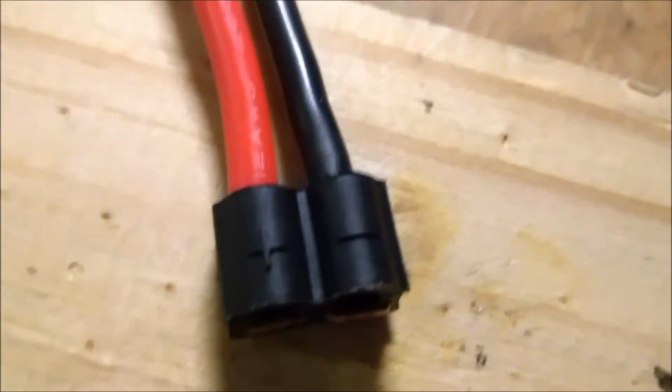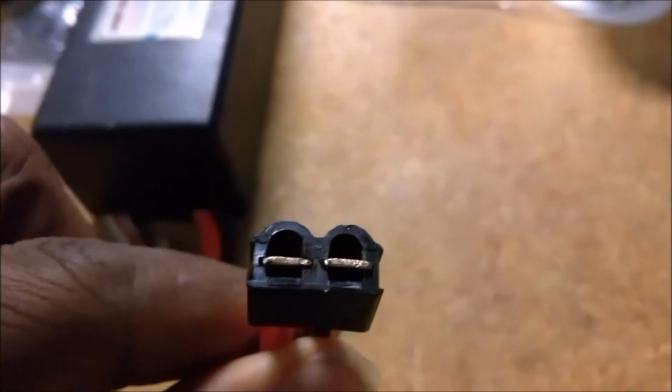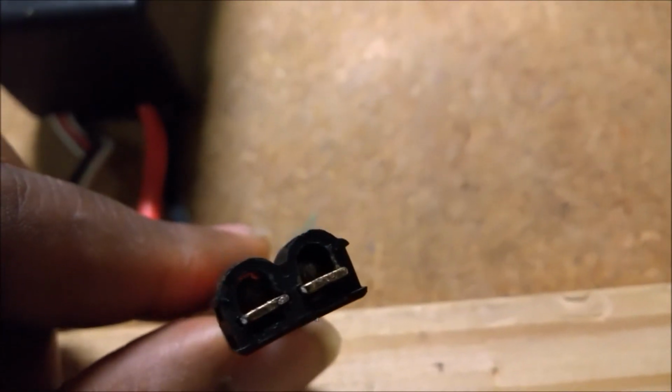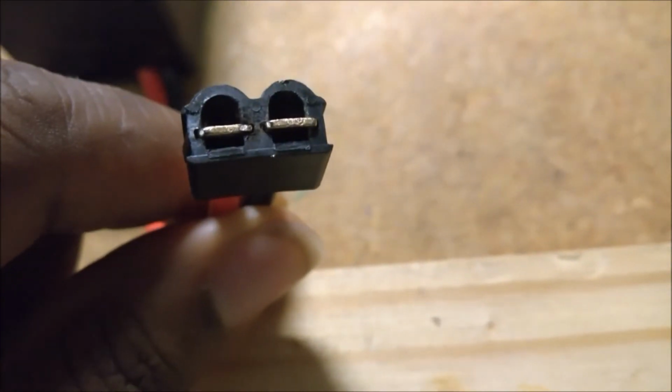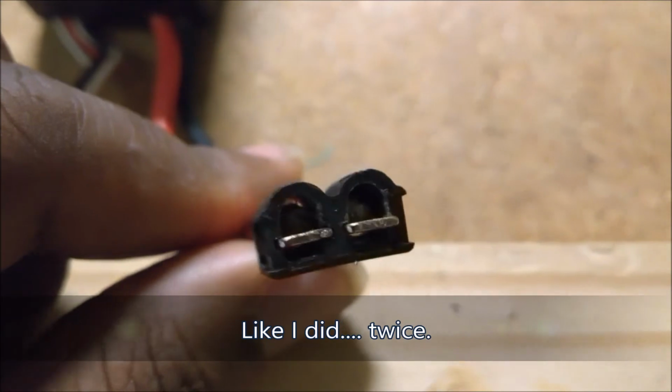So as you can see here on the top of the battery, you've got the positive and the negative connector connected to the proper side. This comes together fairly quickly. I soldered the tabs on and then just drove them in place. Again, be very, very careful that you don't accidentally short the battery's connections, one or the other. So as you see, it's all together there.